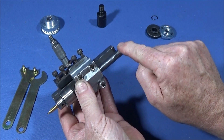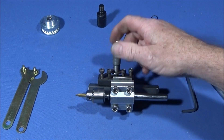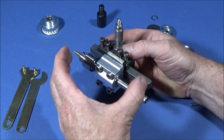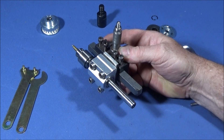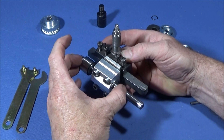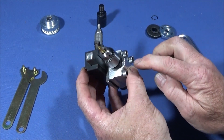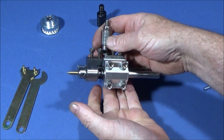If you make them correctly you can slide down on the shaft and see that it's dead parallel to the square bar that goes in the quick change tool holder. If you watch my other videos where I made my own tool post drill housing and the whole assembly, you'll see that you can use a tool post drill in a tool post vice — the tool post drill goes in the vice and the vice goes in the quick change tool holder — giving you double movement, both the vice back and forward and the tool post drill back and forward. I'm really pleased the way this has turned out: it's low cost, easy to make, has really good quality bearings, and the chuck is absolutely brilliant quality — all round a really good piece of kit.